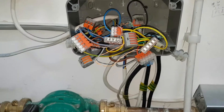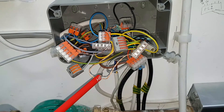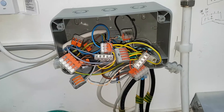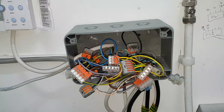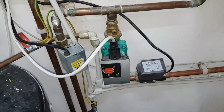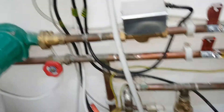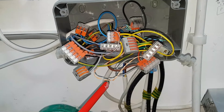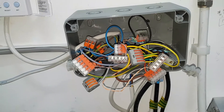Here's a horror story — see this bell wire here. What they've got is this going to the room thermostat. They've got a permanent supply to a room thermostat straight off the spur switch, which turns off one of these valves. So they've got bell wire on this heating system and they're using 240 volts, off a permanent supply to a room thermostat.